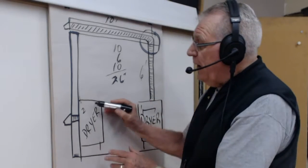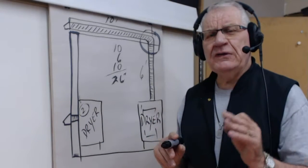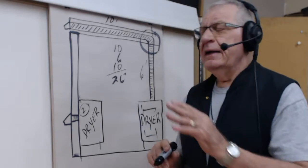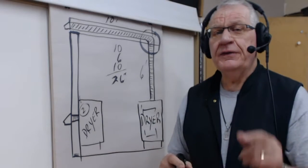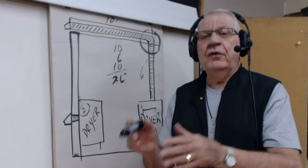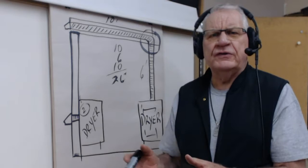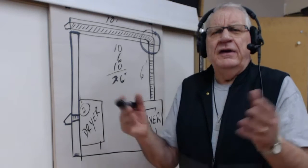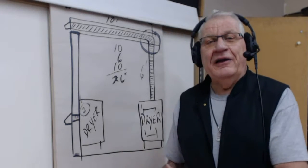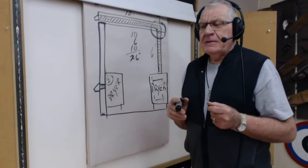Okay? Now, dryer number 2, being that it's directly out to the outside, using still a galvanized or a flexible aluminum ducting is great. You will find there are people that will buy a new dryer because when they move from a home to a condo or vice versa, whatever the case, they think, oh, my dryer's gone wonky. It's not working anymore. It's not drying the clothes. Well, the reason why, very likely in the new place that you've moved into, it's got longer duct runs. So be on the defense.